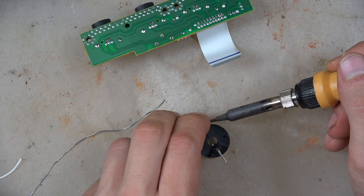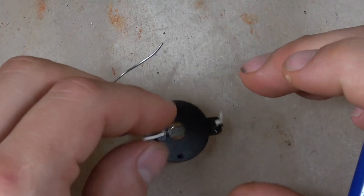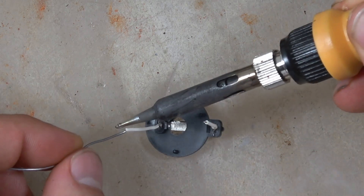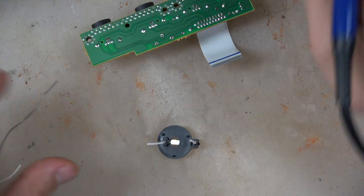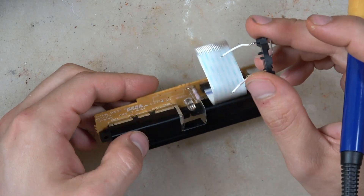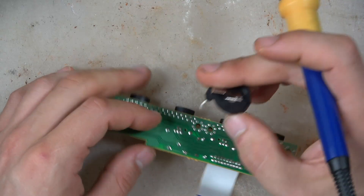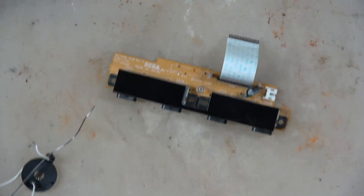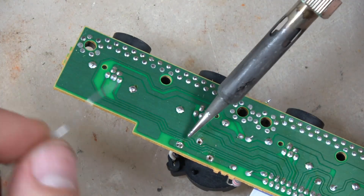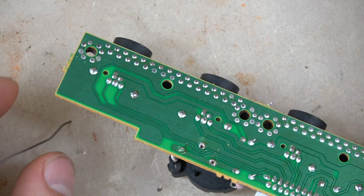Now that we've tinned up the other side, we're going to solder that wire to it. Then we're going to tin up the sides of the wire that are going to go to the actual board and solder it to the board. Your battery holder might be different, but those are the positives and the negative on the specific battery holder I'm using. I'm just going to flow it right through in a simple through hole — heat up the joint and the wire, then flow the solder onto the joint just a little bit. You never need a lot, especially because we already tinned the wire.